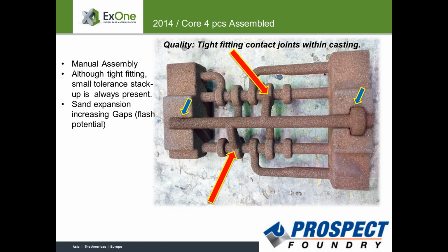Well, actually, first of all, this is Greg Colosimo. We tried several different traditional type methods. We used ceramic type sand on the shell machine. We tried zircon sand on the shell machine. And we tried different coatings, alcohol-based and water-based, and some mullite, aluminum. We tried zircon-based wash. We did just about everything in the book.